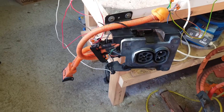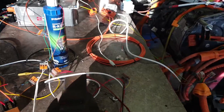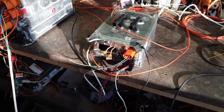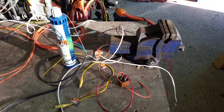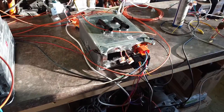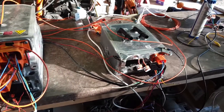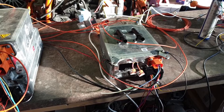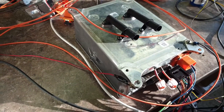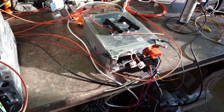What does the charge manager do? Well, the charge manager is the thing that communicates with our charging port — we're now using a non-Volkswagen charging port, but I'll cover that in another video. It controls the locking and unlocking of the charging port, detects how much current our control pilot gives us, and all that kind of thing. It then signals the charger part to commence charging and tells it how much current to send, when to throttle back, and all that — and that's all built into the actual box here.